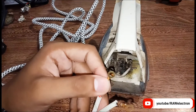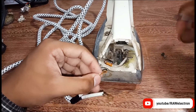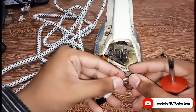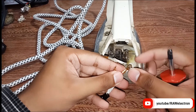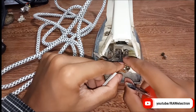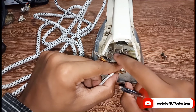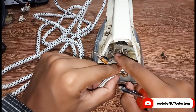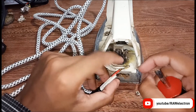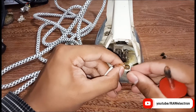Here are two clips and I have two screws. With the help of a screwdriver, since this is AC voltage there is no polarity, I am combining these two — one connection is with the line. As you can see there are two holes: one is for the bulb, second is for the live connection. Center is the second wire of the bulb and outer left is for neutral or live. Let's combine it and carefully put the screw inside.